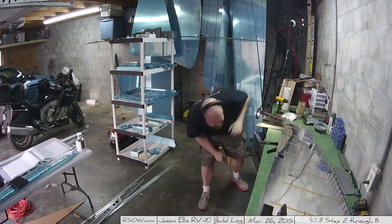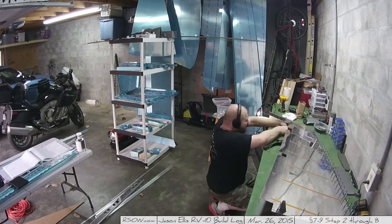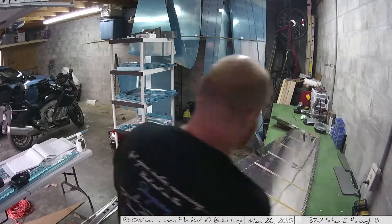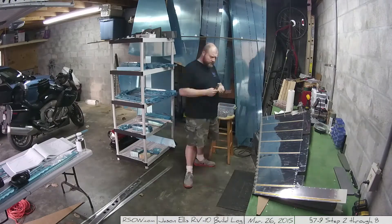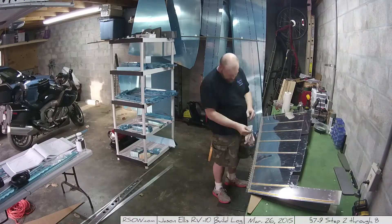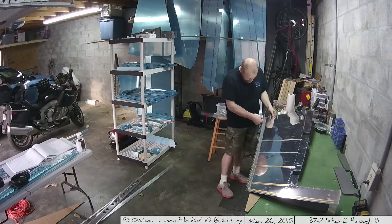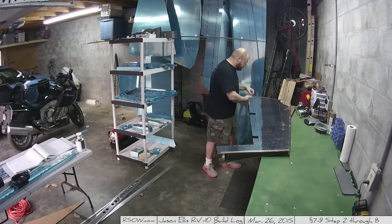There's a point at which you're just kind of done and you can't proceed. The big piece of advice here is make sure you know which piece sits on top of which piece. It's detailed thoroughly in the instructions as to what goes on top of what. Make sure you do it, because if you don't, the skin will actually look slightly folded or a little warped. I intentionally put it the wrong way once — I didn't pop rivet it, just sat it that way to see what it looked like — and you can kind of tell that yeah, okay, that's wrong. It was obvious.